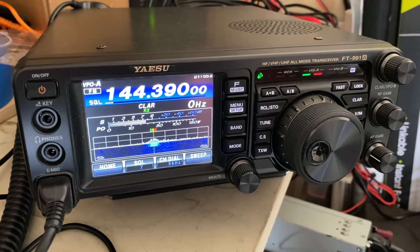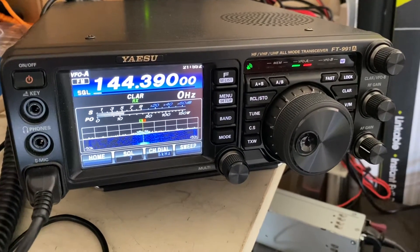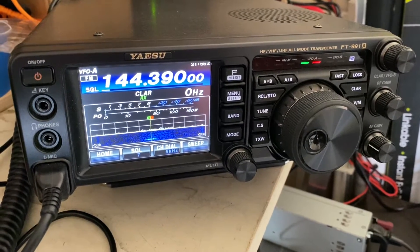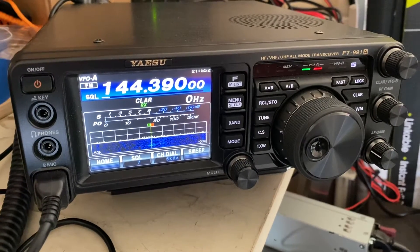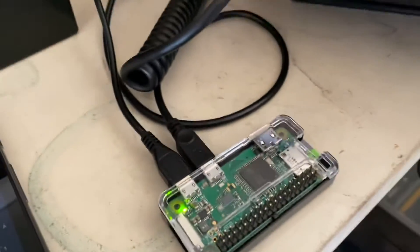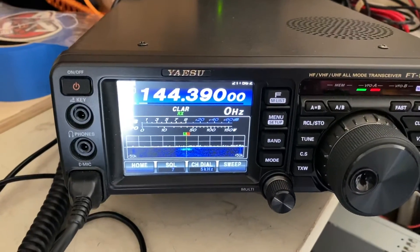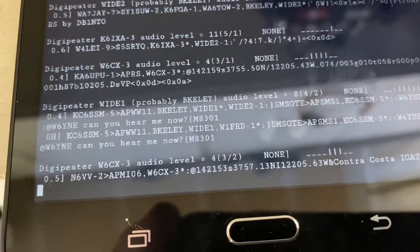It takes a little time. That one probably will go. I can always spark mine to go — kind of waiting to hear it take over the transmit, which it will. We have this thing called collisions. So, just watching it, there's your direwatch log, the DigiPi. See, there's the red transmit — it just digi-repeated that.